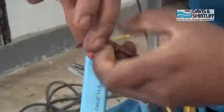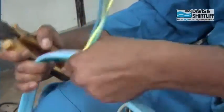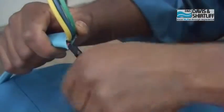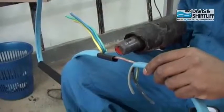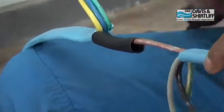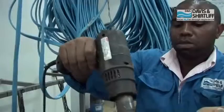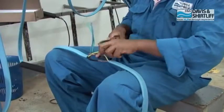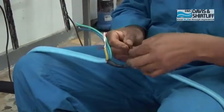Join the ends and protect with PVC insulating tape. Then position heat shrink ferrule tubes centrally over the connection and shrink into place simultaneously, starting from the middle of the tube and applying the heat circumferentially outwards until the sealant has fully melted and the tube has achieved a uniform wall thickness. Apply the same procedure for the other three remaining cords.